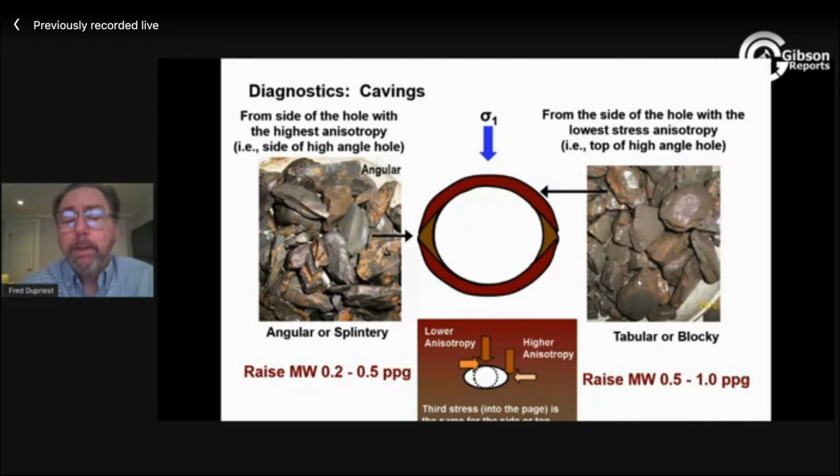Secondly, you need to document everywhere you saw cavings and hand that to the driller, put it on a mud log for tripping or something he can watch and see when the top of his BHA is approaching that section. And be careful. You get a pull, you have a process: drop down, engage slowly, be real careful. Use your documented record of enlargement in real operations and be set up so they know to do that.